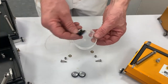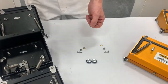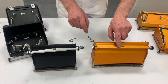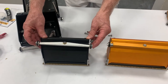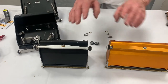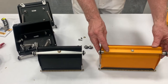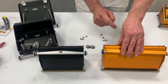You won't be needing the spare o-rings right now — keep those as spares for the future. On the Asgard and TapeTek products you have different axles. The newer TapeTek has wheels for bead, while the Asgard just has the wheels themselves and they're not designed to run bead. On older style TapeTeks you can't just install this kit onto the newer style — you have to get an axle kit and change the whole thing out. You can't simply put these wheels on because they wouldn't align.